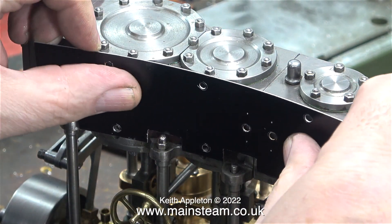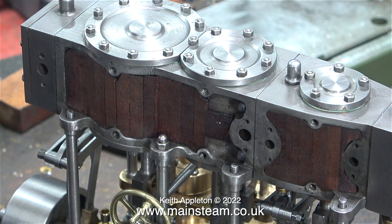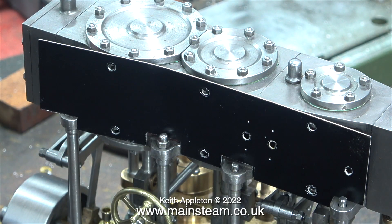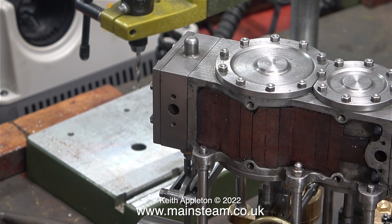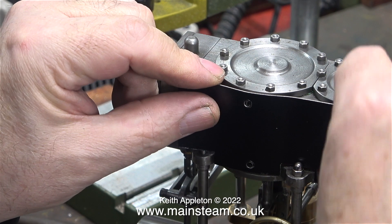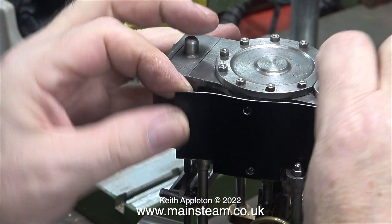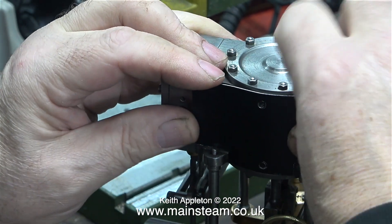The first thing I noticed was it was a little bit tight, so it was back over to the bandsaw to lengthen one of the slots. Then the piece of cylinder cladding fitted in position. This is not going to be easy because the piece of cladding has to be bent to fit around the low pressure cylinder, and the positions of the holes are going to change — that's why I originally drilled the holes smaller than I needed them.